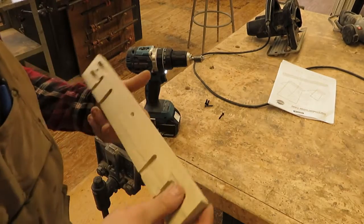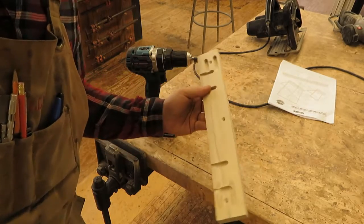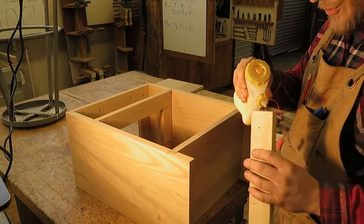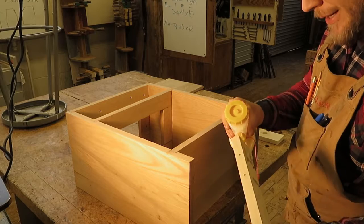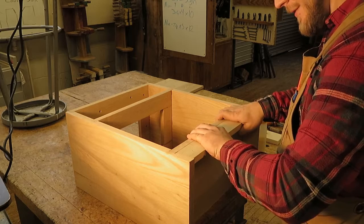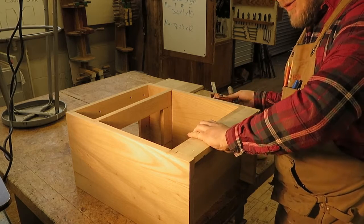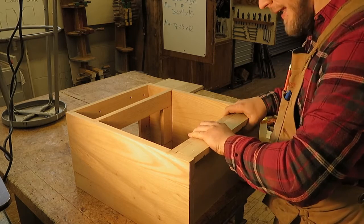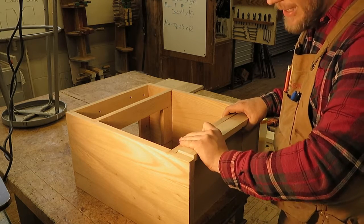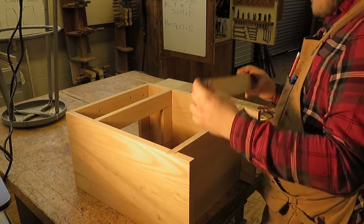The front filler is now ready to be glued and screwed into the case. I'm going to spread glue across the end grain, the top edge grain, and the opposite end grain, then place the front filler into the project. I'll use bar clamps to hold it in place while I screw it — you shouldn't leave it free without clamps because it can shift, and if it's off too much on either end it could push the molding off the project.